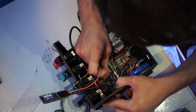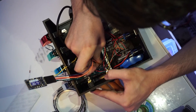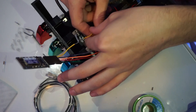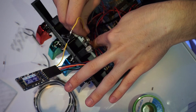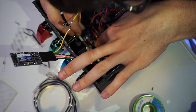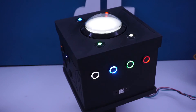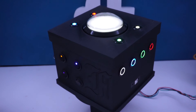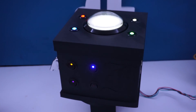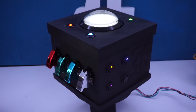This capacitor is needed for programming to be properly initiated, so don't forget it. You can program your Arduino over Bluetooth, however I found that this can be slow and sometimes unreliable, so I still like to upload my code via USB. And that is the hardware portion of the build. In the next video, we will pair the box with the computer and have my computer react to buttons pressed on the box. Let me know in the comments if this build was informative — did I leave out information, or did I go into too much detail? Any criticism is helpful. Thanks so much.